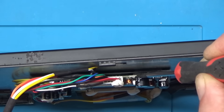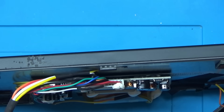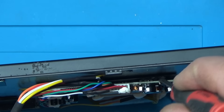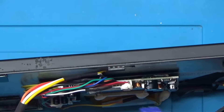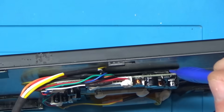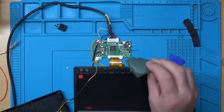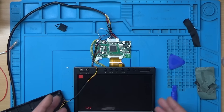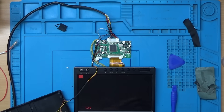I'm not going to put too much pressure on it because I don't want to damage the display. I think the IPA is having an effect, just rather slowly. I've managed to get the board out — it was stuck in by sticky pads and a bit of cardboard. So I went upstairs, washed my hands, came back down and it's actually working now. I guess one of these capacitors warmed up. That one's hot — I'm going to get the thermal camera out. It's about 90 degrees on that capacitor. I don't think that's right.